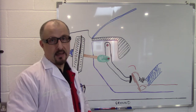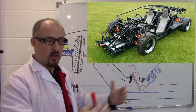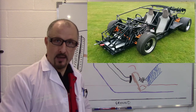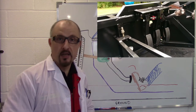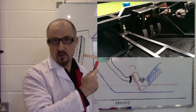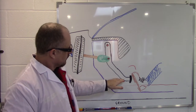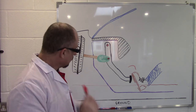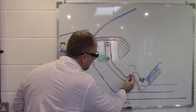If you've seen my Lamborghini Countach chassis, you'll notice that when I took that project on, someone actually did that — they fitted a set of pedals that were so low that you needed to use your heel. So the solution is to raise this area of the pedal — this has to go up.